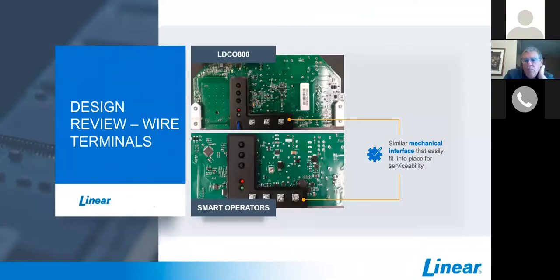2 differences in our boards. Our standard AC and our standard DC are a 3-terminal board, the top one. What that means is terminals 1 and 2 are non-polarity to the push button. And I'm going to show you a push button. Non-polarity means we don't care which 2 wires attach to terminals 1 and 2. And 2 and 3 also doesn't care on your photo eye. So for an installer, it's quicker to install our opener because he doesn't care about wire colors. He just has to hook them up to terminals 1 and 2 for the push button and 3 and 4 for the photo eyes. 2 and 3 for the photo eyes on standard product.